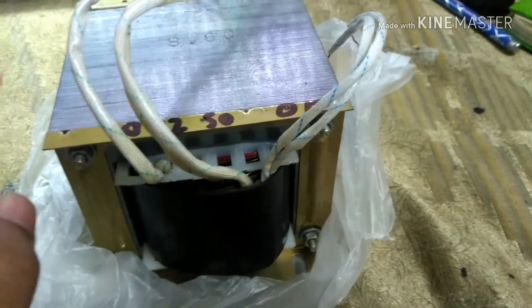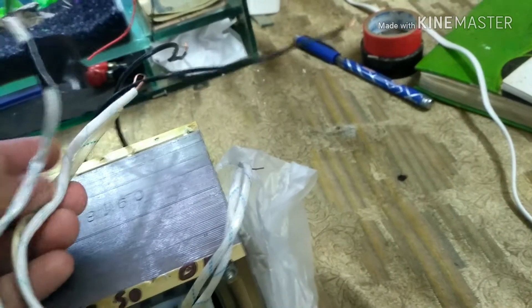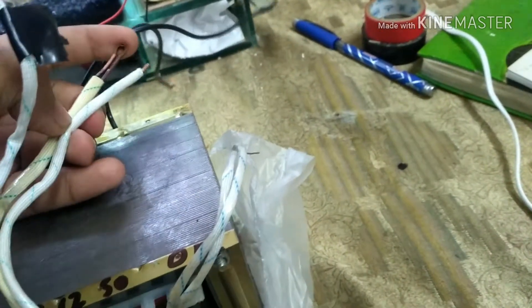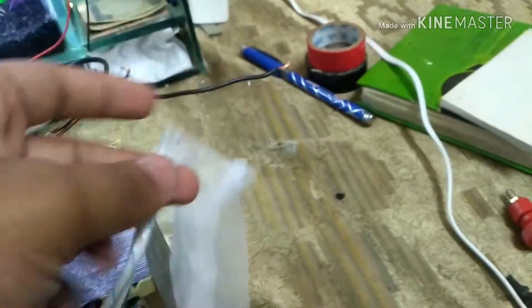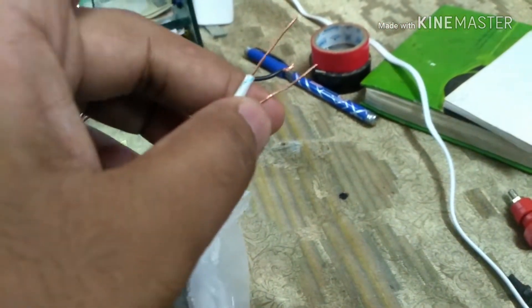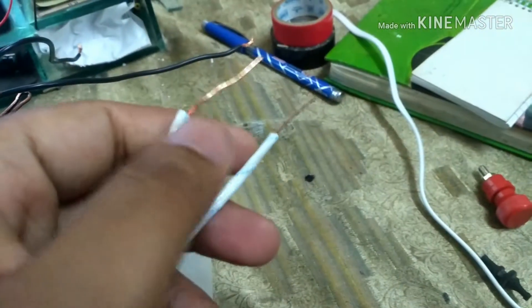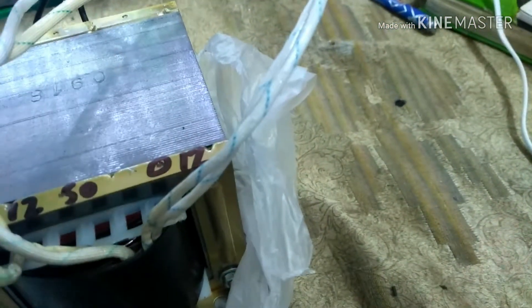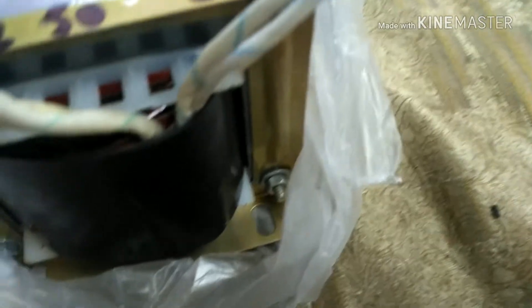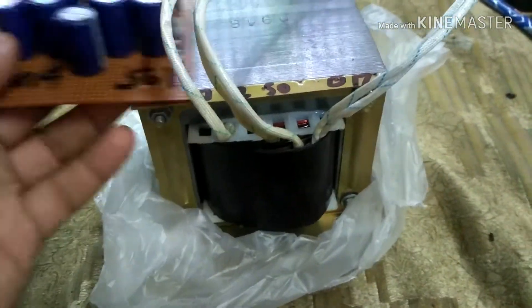The wiring: the black wire is the 0V common, the thick wire is 12V, and this wire is 50V. I also have a separate 2 ampere 12 volt output. One terminal is common, and there are multiple 13V AC taps as well. I've also built a rectifier circuit for it, which I'm now considering a bit underpowered.